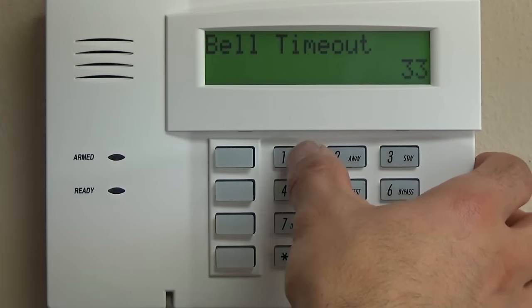Star 174 is a cleaning report for fire devices, which we want to have as a zero. Star 177, some miscellaneous stuff there for a device duration, 00. Star 181 is going to be zero for 60 hertz.